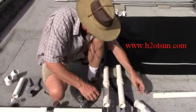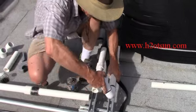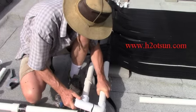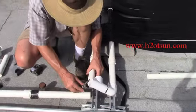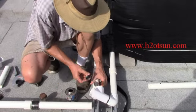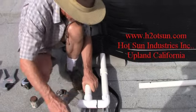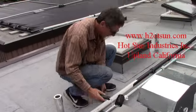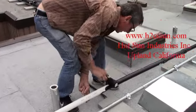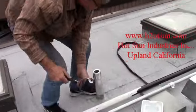Now we want to rotate this. So what we're going to do is glue this on here, get our rotation, rotate it up a bit, then we'll glue this one. Our angles look good. I like to paint with a small roller here because you can get under the pipe. You do this before you secure everything down — obviously do these things in the right order.